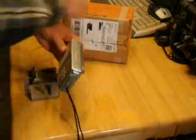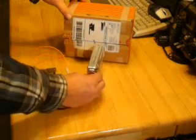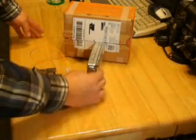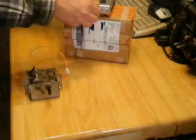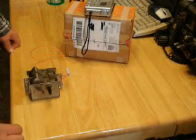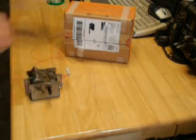You want to have the coil of the ferrite bar aligned with the coil that you've wound. Ideally this would be right inside the middle of the coil, but just placing it next to it provides a good boost in reception. You can place it along the side, lay it on the top — either way — and you adjust this for the best signal. It's very simple: coil of wire, variable capacitor.